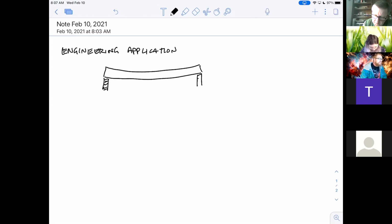So if you have a beam that's under load, it's going to bow down. And at some point, it's just going to break. It'll probably break in the middle if everything is kind of normal. But basically that whole beam, if you think about just kind of the left half of it past the crack over there, that whole part of the beam wants to rotate downwards. And basically it's trying to split the beam apart in the middle. That's called moment or torque.